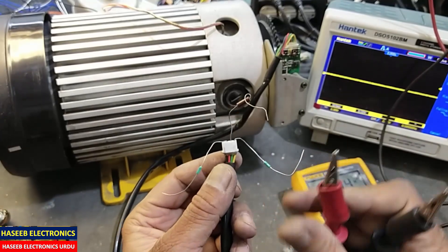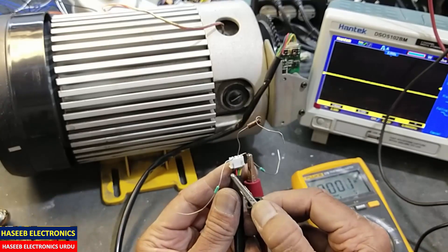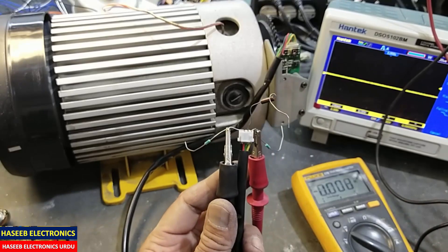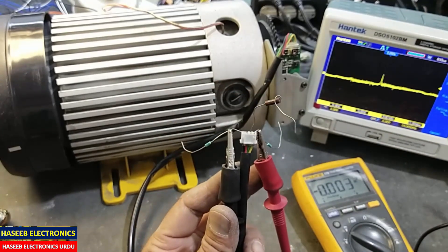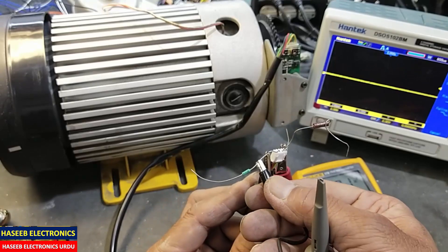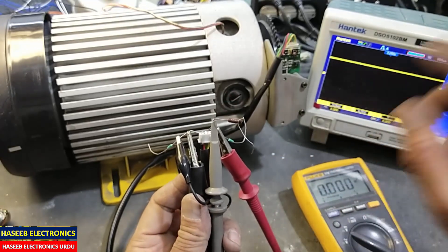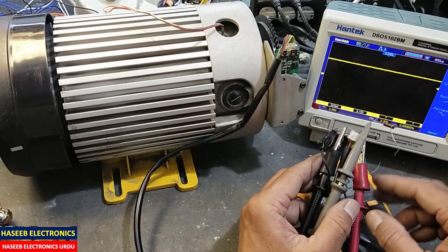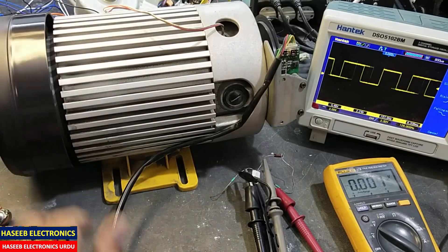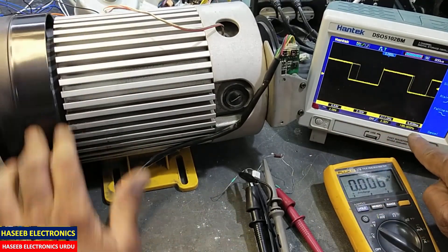We will apply 5 volt to the yellow wire — the rightmost pin. Always take care of the polarity because it is a TTL IC — there is no second chance. Connect ground to the ground pin. I will connect the oscilloscope, set to attenuation 1x, ground wire to the ground pin and the signal wire to the output. It is showing 4.1 volt.